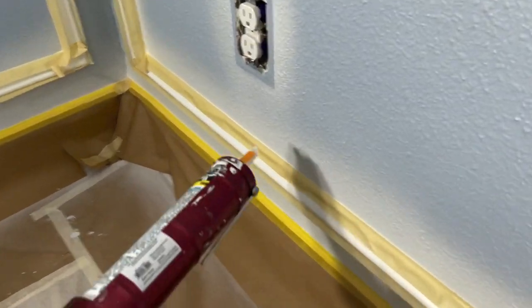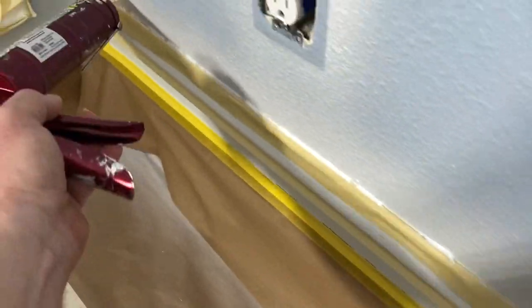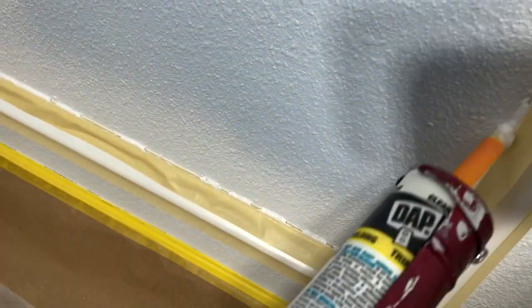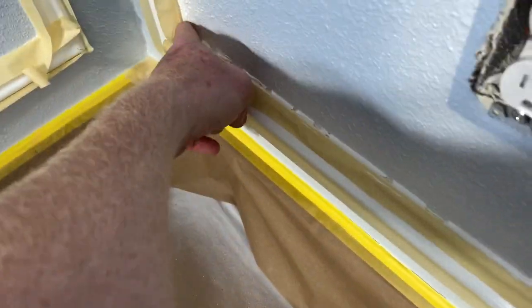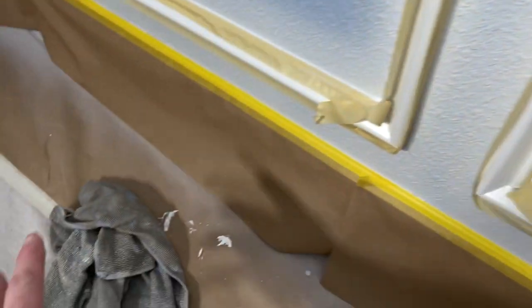Now, what I'm going to do is fill in my caulk, right? I don't want a lot of caulking. It's easy to go fast and just pour out a blob of it. But we don't want that at all. So, with the damp cloth handy, you just want to take your finger. You want to take two because it starts getting caked up. Just make sure that it's sealed, okay? Theoretically, you could go to this one, but this is what this rag is primarily for, to just wipe it off, making sure that you have a nice, thin bead of caulking.